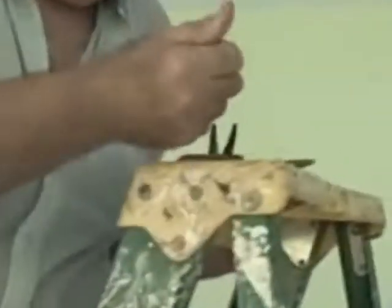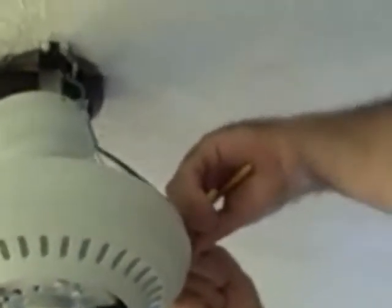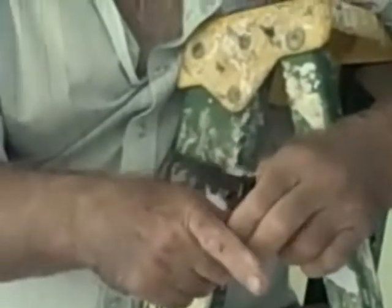When you cut off wire, you don't want to be too long or too short. I have these three ends sticking out over here for the fan — they're about four or five inches long. I'm going to cut them a little longer, about here, so I have some flexibility to put the ends together. I can cut all three at one time. As a review, I'm going to strip the ends to make them bare. This I happen to know is a 14-gauge wire, and if I put it in my stripper it takes the end off — it's primarily cutting the insulation. I need about three-quarters to one inch of bare wire, which is about what I have here.